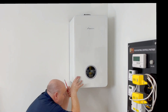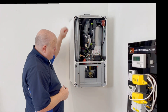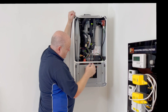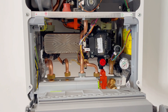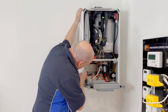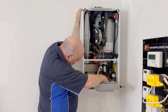This is the first Worcester I've installed in a long time — I used to install Worcesters every day, loads and loads of them. One thing to point out is the side panels come off should you want them to, which makes it easier to get in. When you look inside, the first thing you notice is the PRV is on the front, which is a lot better than previous models where the PRV was on the back.